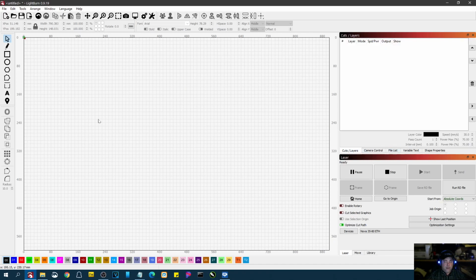The biggest thing about the laser is it could be almost fully autonomous. You can put in your piece of wood, hit the autofocus button, and it'll focus for you. Then you've got your dual air assists, and the software selects between those automatically. When you start a job or send a job over to the controller, you can have it automatically begin the process. The exhaust fan will kick on, the laser will start processing, and the correct air assist will come on. If you're doing engraving, the low stage air assist will be on and it's adjustable. Then when you switch to the cut layer, the high air assist will be there. So you have that kind of granular control, but it's pretty much automated.